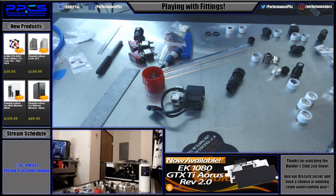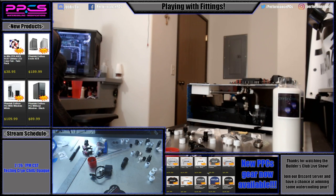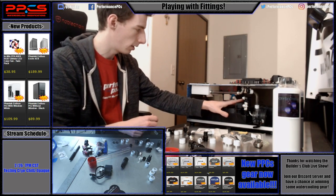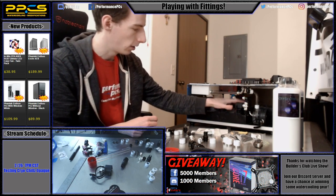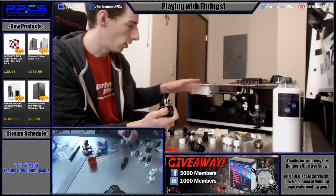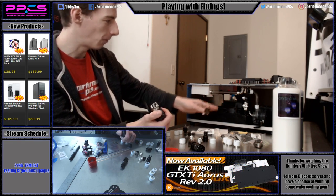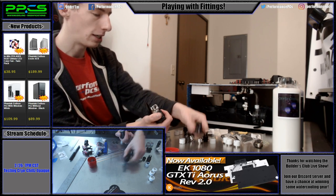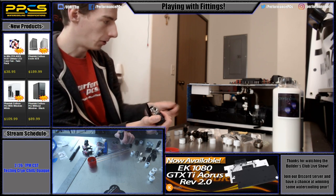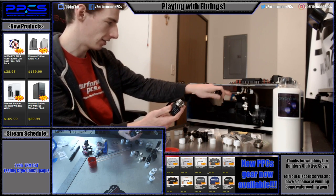Yeah, see, what I usually do is, maybe here, I'll switch to this one. So maybe this will make it big enough, but I'm just trying to get the two ports from the rad to have these magnetic ball valves off of them so I can shut off flow to them, all the while having to get these 180 T's in here somewhere too, so I can split the flow so I can get tubes to the front of the case for these bulkhead disconnects. So I have to fit 180 T's and ball valves into this area somewhere.